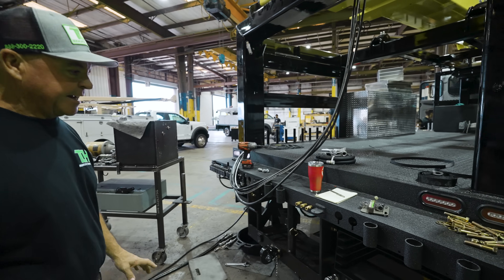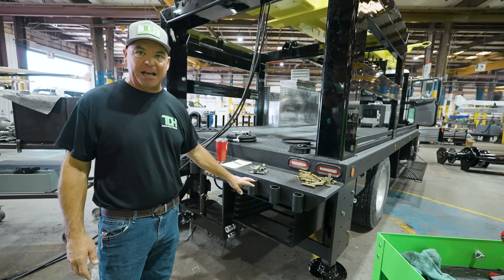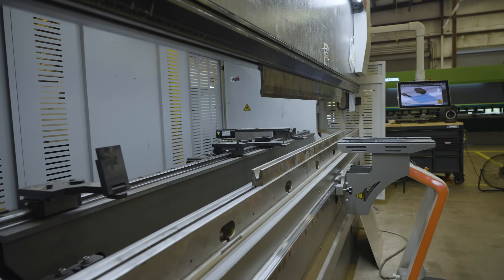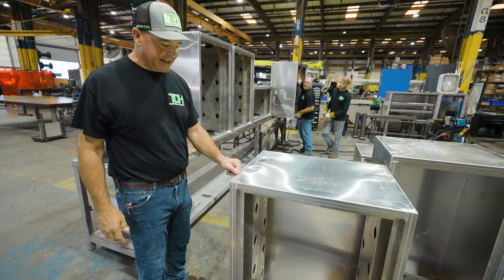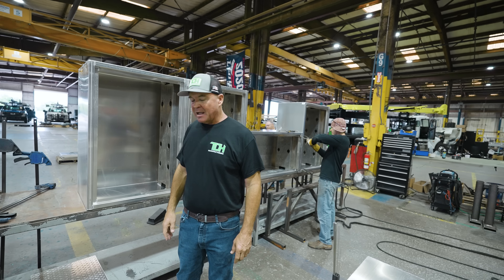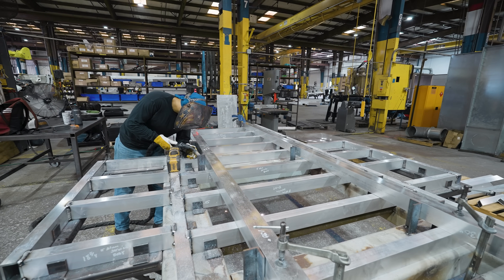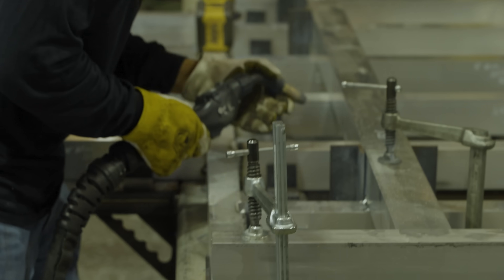We're putting all the toolboxes on. We did a lot of custom work on this rig for features a customer wanted. We take all the aluminum sheeting cut on the water jet, it goes to the press brake and gets bent, and then the guys are over here jig-welding the aluminum together. They're laying beads that look like stacked dimes. It starts on this fixture — we cut all the tubing, weld it together on the fixture, and then everything comes together in the process.